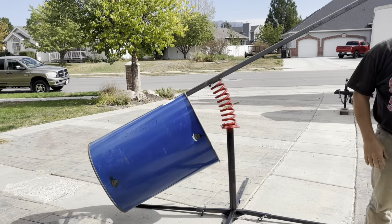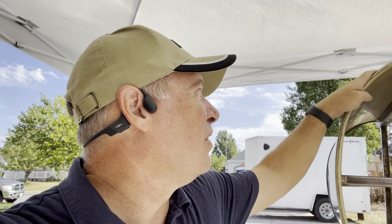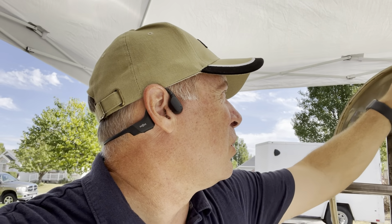All right, just want to give you an update. Done a few things, didn't film them, but put more supports inside here so that we got the up and down support so that it doesn't cave in when they're sitting on it. Put the welds here and then down at the front also. I didn't weld the whole thing, so I don't think you need to do that. Just got welds on both sides.